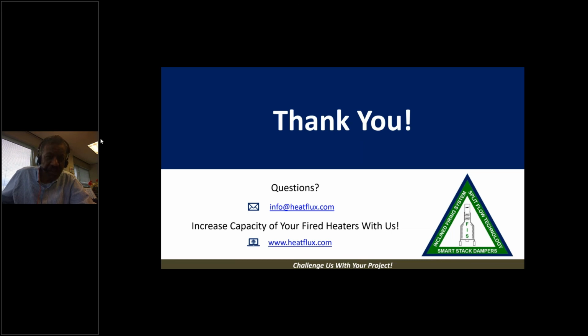So what is the revamp duration, the downtime of the unit? Typically, since we limit our modifications to the convection section, and convection sections can be fully shop fabricated, the time for most of these projects has been like 2 to 3 weeks, depending on what other modifications we are doing.